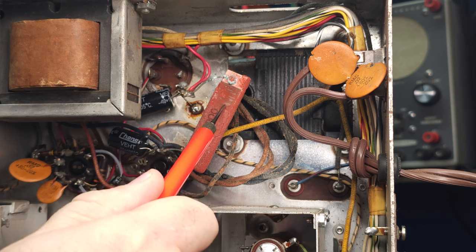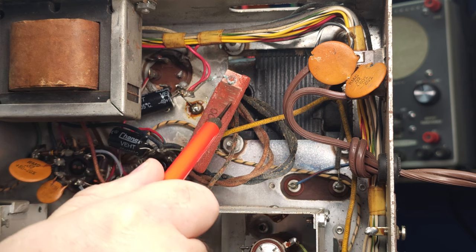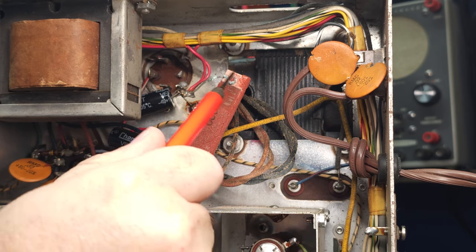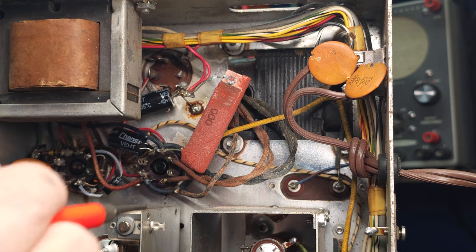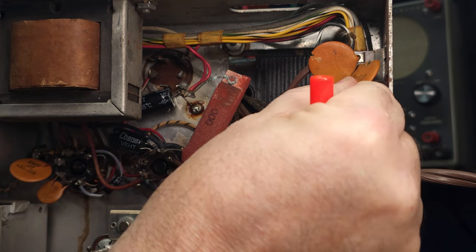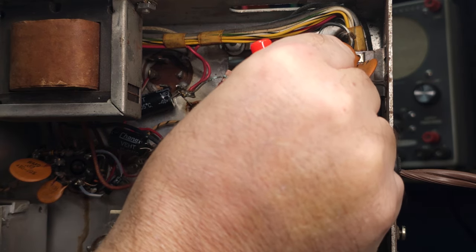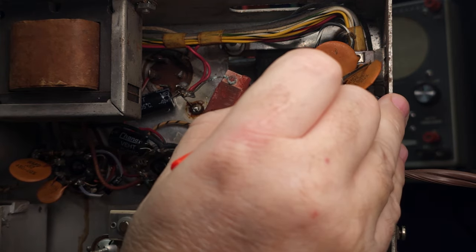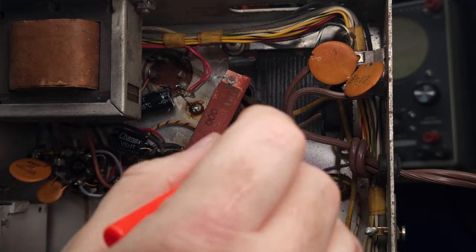You can see the wires here and that the ceramic coating, whatever it is, I guess, has chipped off and the wire is beginning to corrode. So those are a couple of initial problems I see. Now, I'm not sure how well you can see this on camera. These are supposed to be the AC filter caps that take out transients and other types of noise and whatnot. But it's got a hole blown in it here, and it's got a hole blown in it here.